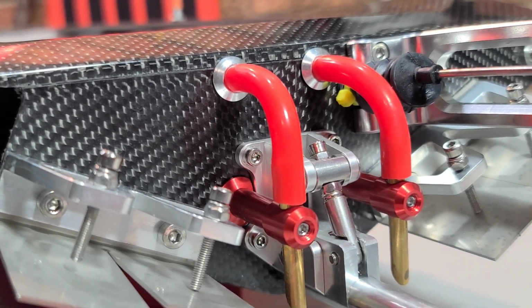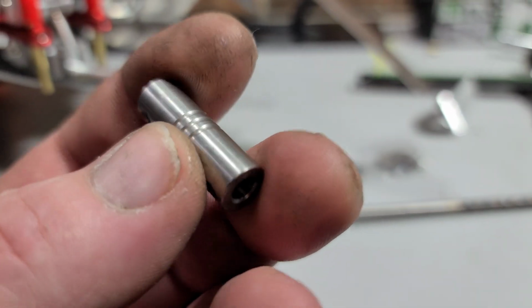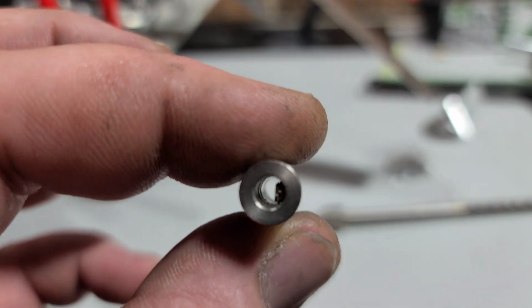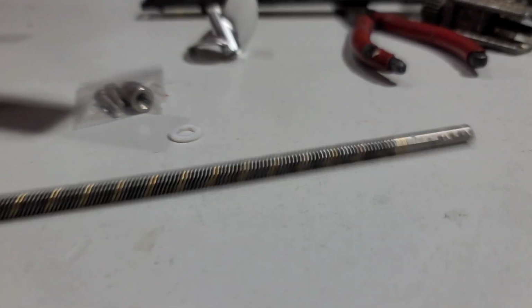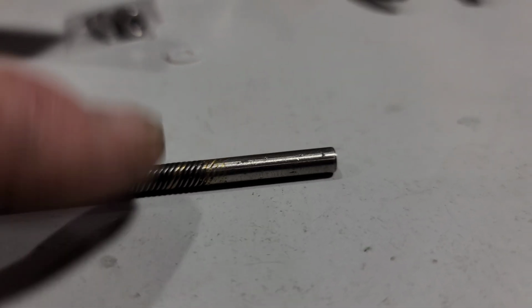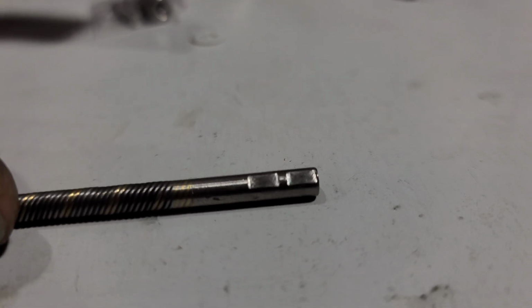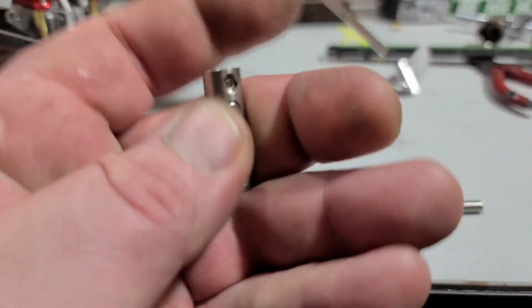So now we need to work on the coupler and the flex cable. I like this coupler. That's actually nice. It's stainless steel, with 4 grub screws to hold your cable in place. The cable has 2 flat spots cut on the end. It's welded right here. 2 flat spots to cinch down the grub screws on so this bad boy doesn't go nowhere. I got my blue Loctite.